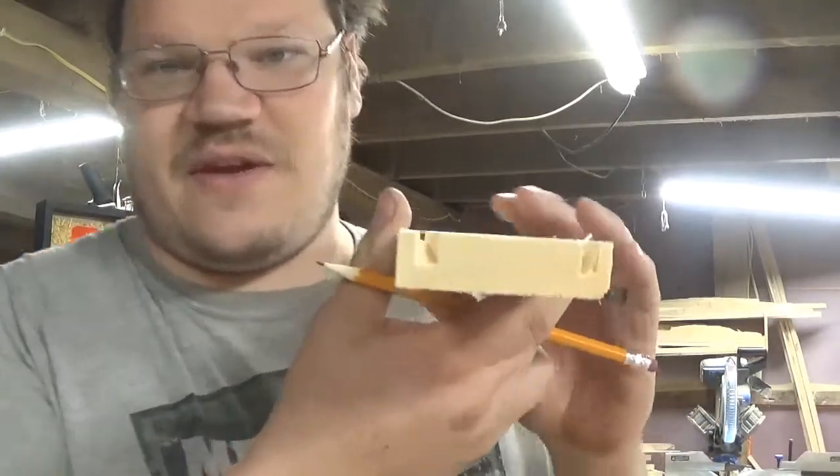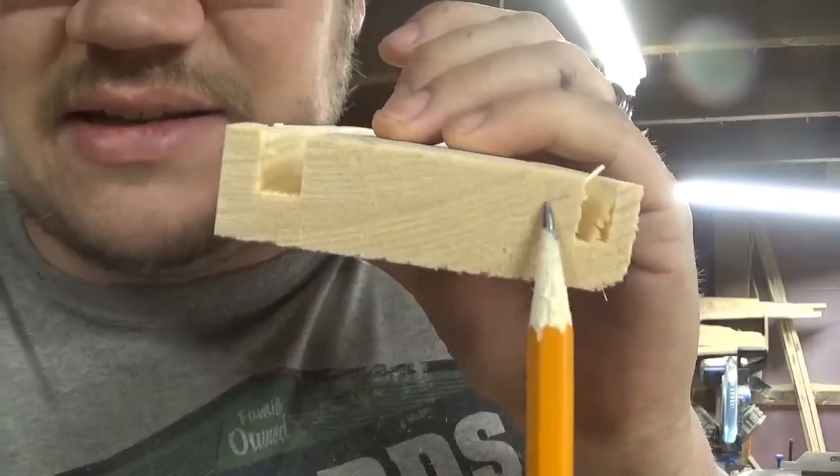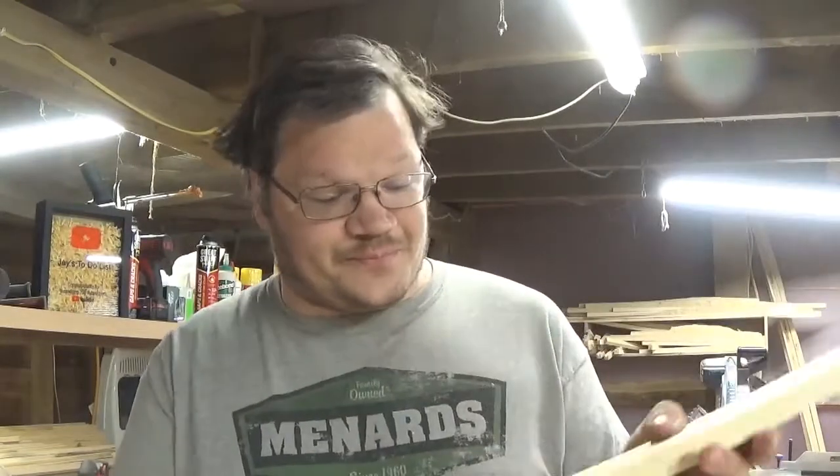First of all, it's about wood selection and how we can get the most for our money. You can get lumber pretty cheap at the hardware store, whether it be Menards, Lowe's, Home Depot, or a standard lumber mill. What you need to look at is the edge grain of your board. I've got a 1x4 here as an example of what not to buy when you want to make quarter-sawn lumber cheap. This is flat-sawn or plain-sawn lumber, not quarter-sawn lumber.